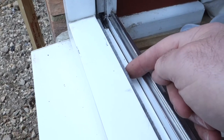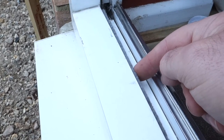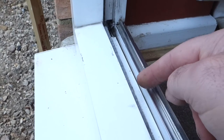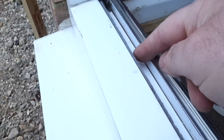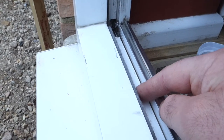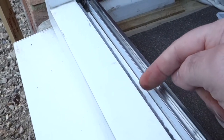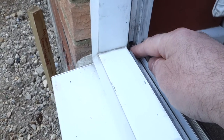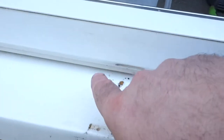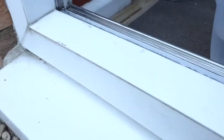The reason why is this channel here is on the outside of the door. This brush seal tries to do its best to keep most debris out, but eventually you'll get wind-blown debris, leaves, broken leaves, dried-up dirt, dust, and goodness knows what. And this is a water channel, believe it or not. Any moisture gets between the brush seal and, hopefully, in heavy rain for instance, it goes down there and it should come out — you should have a little slot drain here. You can see the stuff that's already coming out.